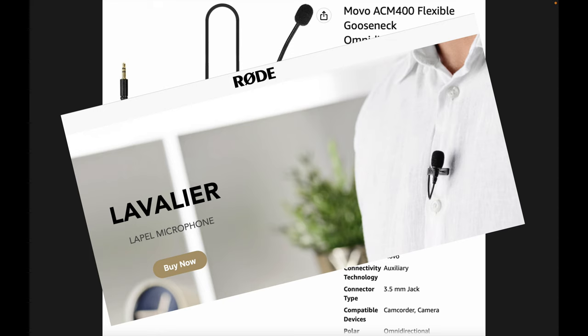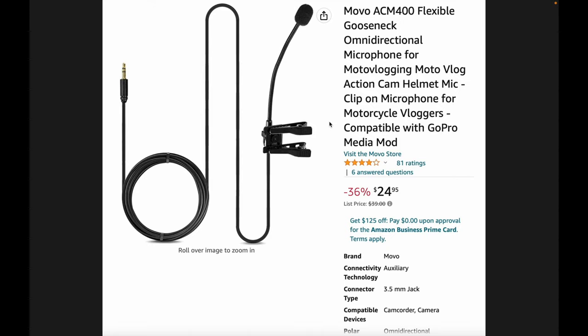The microphone I'm currently using is an inexpensive Chinese mic from Amazon, pitched as a moto vlogging microphone. There's nothing special about a moto vlogging mic other than having the right connector and a form factor that fits in your helmet — this one checks all the boxes. I liked the bendable gooseneck which gives something solid to tape into the helmet. I've also tried expensive lavalier microphones and they work well too, but the cheap ones are essentially just as good. You want a low-sensitivity microphone for this application — highly sensitive mics pick up the smallest sounds but don't do well in a loud environment. On a motorcycle with wind past your helmet it's a very noisy environment, and a highly sensitive mic will give you clipping and distortion.